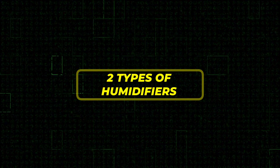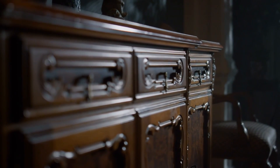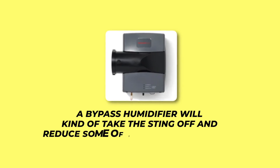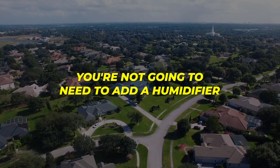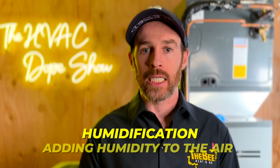There are two types of humidifiers: a steam humidifier and a bypass humidifier. A steam humidifier is the way to go if you want to really add humidity — especially if you have high-end wood furniture, wood floors, guitars, or pianos, as it helps keep pianos in tune longer. A bypass humidifier will take the edge off and reduce static electricity. If you already live in a very humid climate like Texas or Florida, you don't need to worry about adding a humidifier at all.